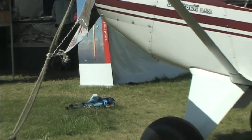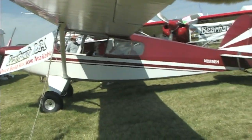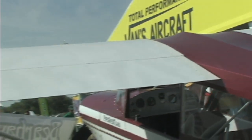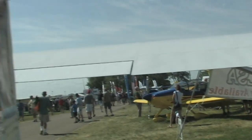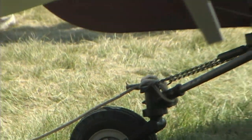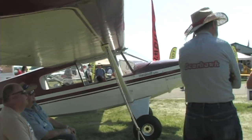We probably learned a lot from kitting the other planes, so this one's even more refined. What type of kit is this? It's a welded 4130 fuselage, and the landing gear is 4130 welded with a spring hydraulic shock system. The tail feathers are also welded tubing and metal ribs. The wing is all aluminum — a type of construction that's been around for years and used on the other Bearhawks. It's flush riveted for maximum efficiency and strength.